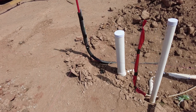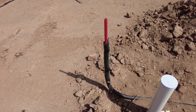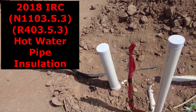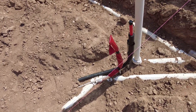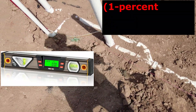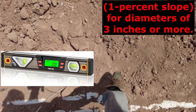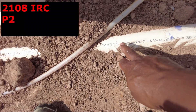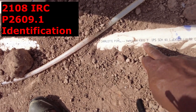I make sure that any supply hot water piping is insulated. That red PEX there — hot water piping that is under floor or buried must be insulated. I'll take my level and check the slope of the drainage piping. I'll also check and make sure that the manufacturer is listed on the actual piping — Charlotte Pipe — and it's a three-inch drainage line.